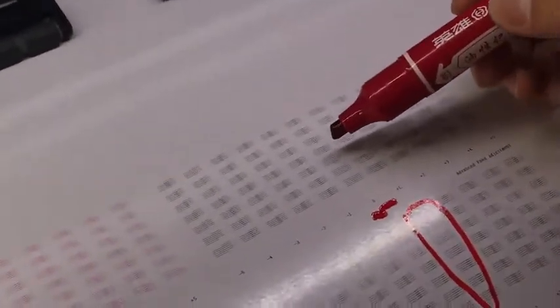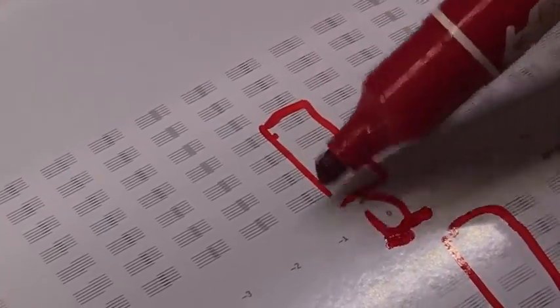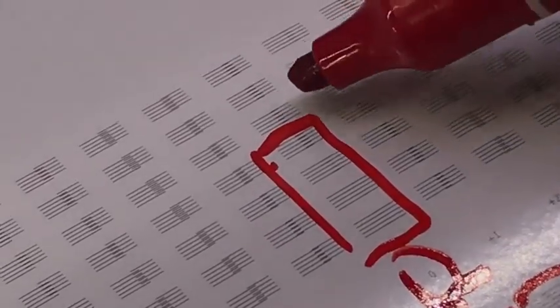You can see zero was here. So 1, 2, 3, 4, 5 pass, no problem. And 6, 7, 8, maybe a little problem. So you can see here is minus 1, here is plus 1, which is better. Plus 1 is better. So I still plus a little. Maybe I plus only 0.08 and print again.